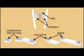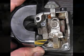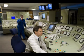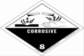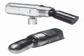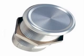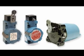Switch contacts can be ruined by contamination. One major disadvantage of standard switch contacts is the exposure of the contacts to the surrounding atmosphere. In a nice clean controlled room environment this is generally not a problem; however, most industrial environments are not this benign. The presence of corrosive chemicals in the air can cause contacts to deteriorate and fail prematurely. Even more troublesome is the possibility of regular contact sparking causing flammable or explosive chemicals to ignite. When such environmental concerns exist, other types of sealed contacts can be considered for small switches, as they do not suffer the same exposure problems. Some switches are designed for environments where there might be flammable gases — these are called explosion-proof switches and they use sealed contacts.